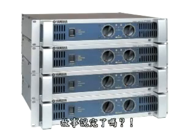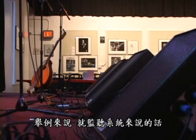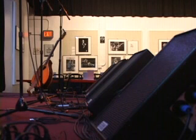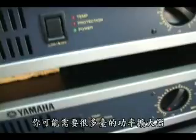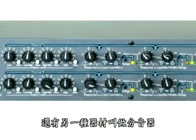Is that the end of the story? Not quite. One amplifier will not necessarily do everything you need. If you're running a full monitor system, for instance, you'll probably want to use a separate amp channel to power it. Also, if you're running a multiple speaker setup, like main speakers plus subwoofers, you'll need separate amplification for each, plus another piece of equipment called a crossover.